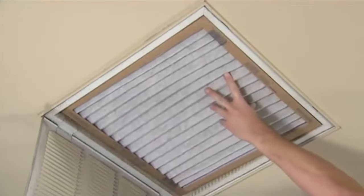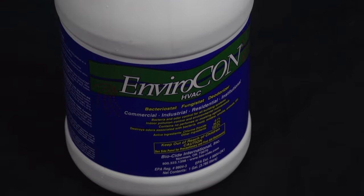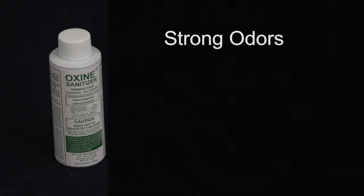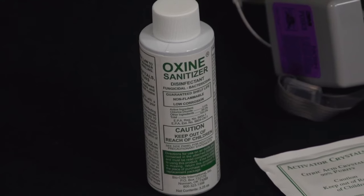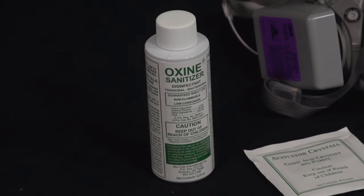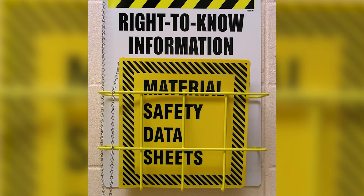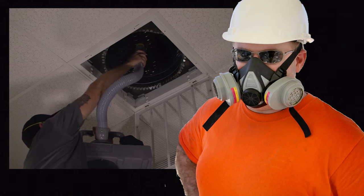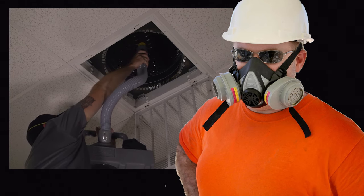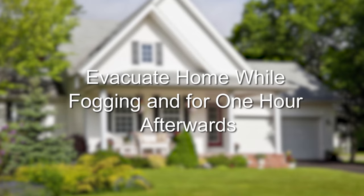Lastly, install the filter, close the door, and turn on the air handler. Always keep your chemicals in a climate-controlled environment to prolong their life. Envirocon is what you use for normal day-to-day duct cleanings. When you run across strong odors, fire damage restoration, or remediation work, you will need something with more strength. Oxine is basically the same thing as Envirocon but at a higher concentration. Because of that, there are more requirements — it is all stated in the MSDS sheet. The most important requirement is use of organic vapor acid gas respirators, identified by the yellow band, worn during both mixing and fogging. Also make sure the home or business is evacuated for at least one hour, and that nobody is in the home while you are fogging.